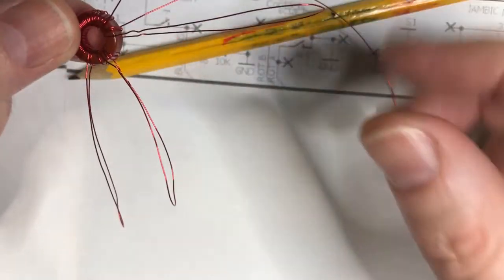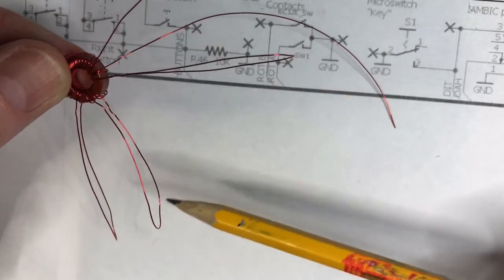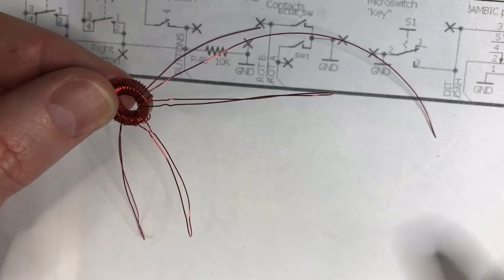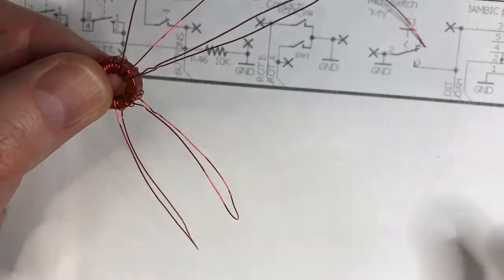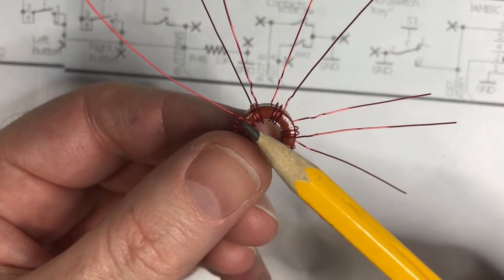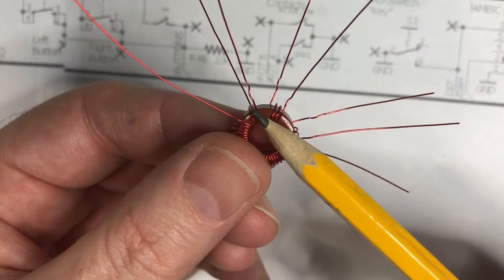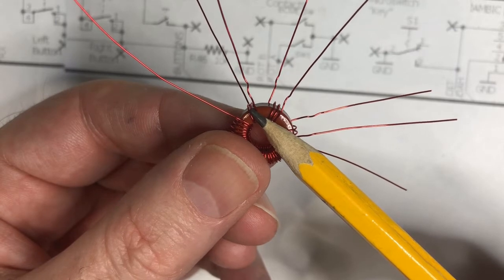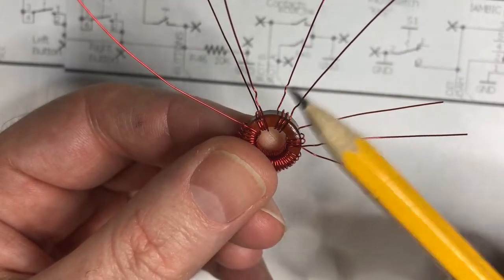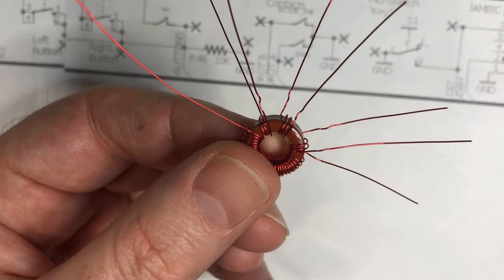Here's the semi-finished toroid with the three extra loops. The next stage is to cut the loops and then we'll have the separation between the primary and the three secondaries. So the transformer is fully wound — there's the 30-turn secondary, here and here are the other two three-turn secondaries, and then here is the three-turn primary. The next step is to tin all these leads to burn the enamel off with the soldering iron, and then install it on the board.